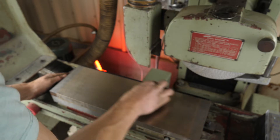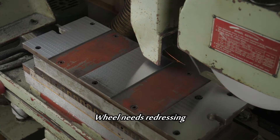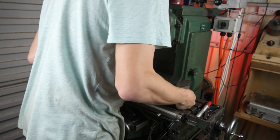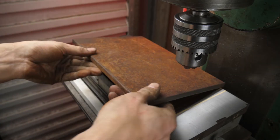I really need to make a set of precision ground flat stones — but don't worry, we'll get there. I'm actually planning to use this mag chuck over at the mill. I want to use this for unconventional work holding — I want to clamp a large flat plate to the mill and use a face mill.